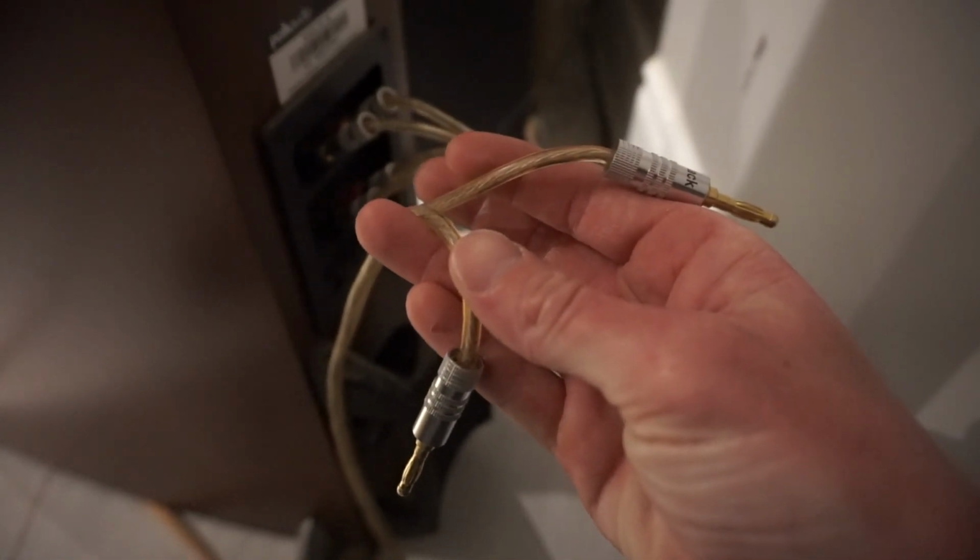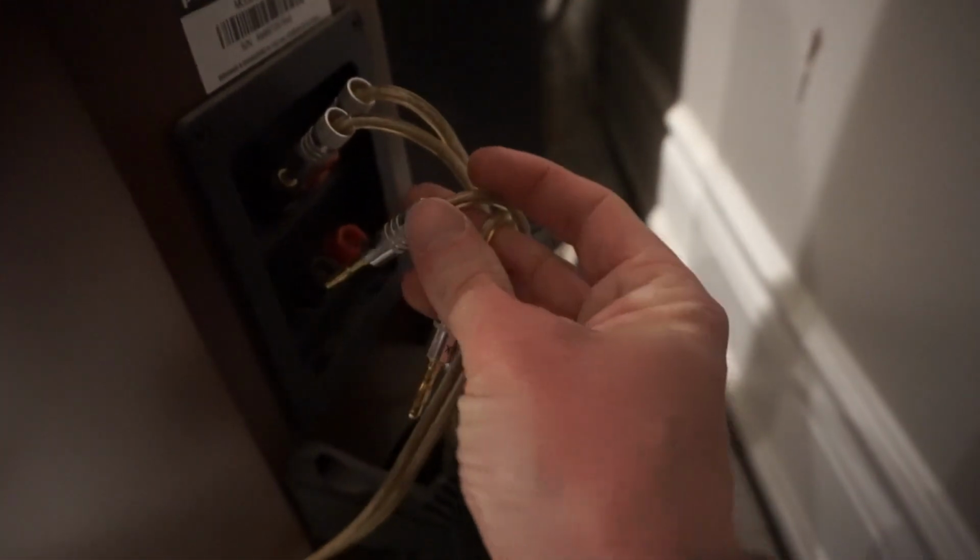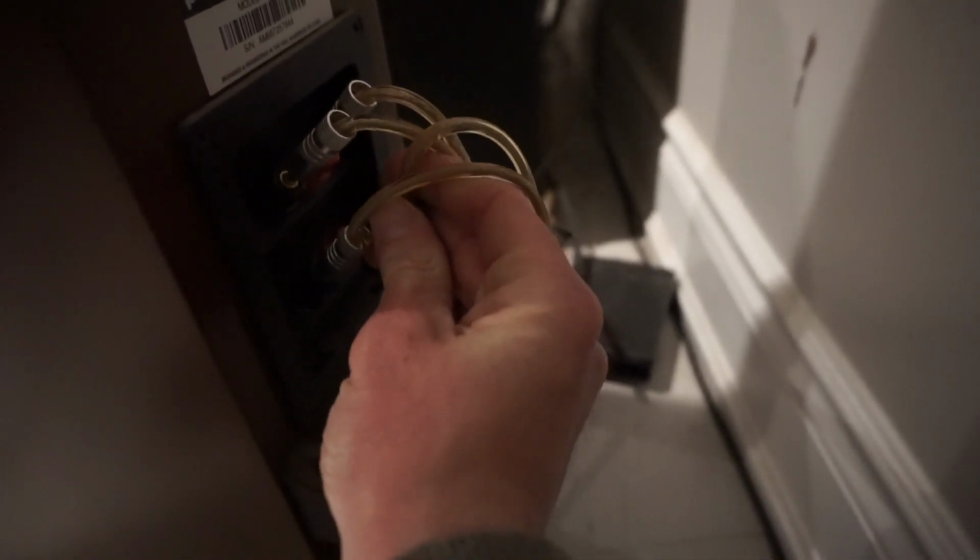So what you do is come around here to your speaker, and mine are bi-wired normally. These are my rear surround banana plugs right there. I already have my binding posts out, and I just have bi-wire cables that I made go into my highs and lows already, so it doesn't matter which one you unplug. We'll just stick those there so they don't touch anything. Unless you have an active EQ, you're basically going to be getting the same signal through both wires that you plug in. And then we'll just run over to the other channel and do the same thing.